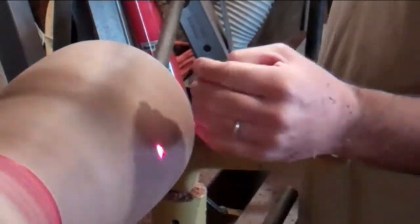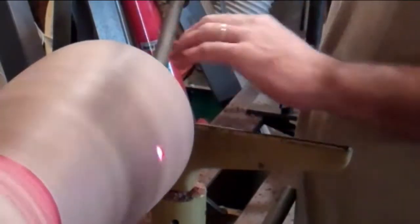Start getting to the edge, you go down to where it falls off, and you can end up having a rough spot in it because it's not going to be perfectly even. So what I do is once I get it to where the laser falls off, and before I go very far to keep support, then I find that edge where I'm at, and then I slowly move back and forth where I'm just taking off just a hair, and you can feel it. It takes a feeling, but you can barely feel it. Where I'm just barely taking off anything, I go back and forth so I clean that off. So if there's any rough spots, I just barely go real smooth, and I do it more by feel and not using the laser, because the laser will actually fall off sometimes.